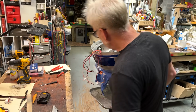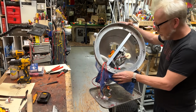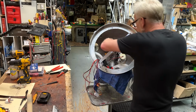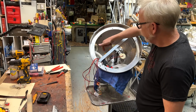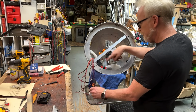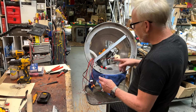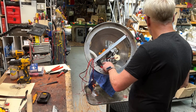I have, first of all, I'm very pleased with how this looks. It's nice and neat. I don't have a lot of wiring going into strange places. Everything is pretty straightforward. I've routed the master power from the battery holder out to the lamps for the color wheels. I have also split it out to this 3-volt step-down transformer, out to the motors, which are running on 3 volts. I may run another resistor into this one to run it even slower.